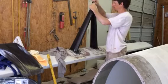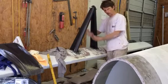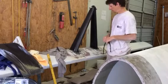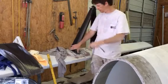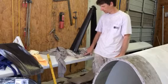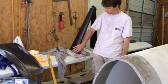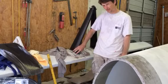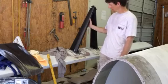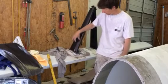Once that was done I took the biaxial carbon and laid it around this — it overlaps on the inside of both. Four layers of 200 grams per square meter six-ounce biaxial carbon, going all the way into the beam. In the beam there's a 600 grams per square meter 17-ounce layer, then another smaller 600 grams per square meter piece, then four pieces of 200 grams per square meter six-ounce carbon. The biaxial 45-degree carbon laid here tapers down into the wing so it's all connected in one piece.